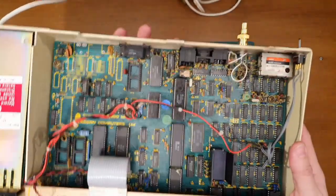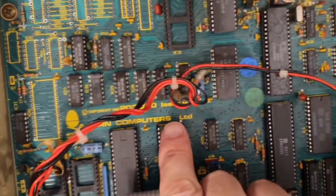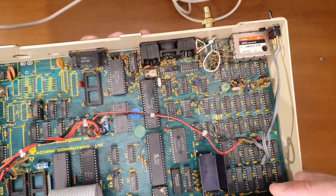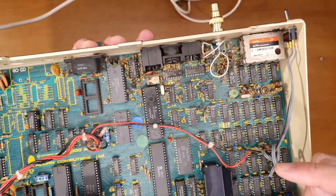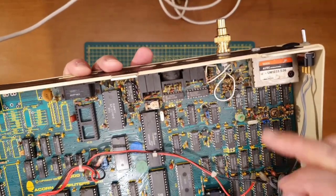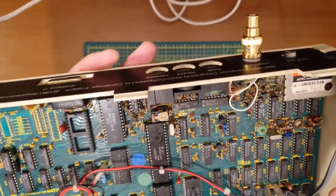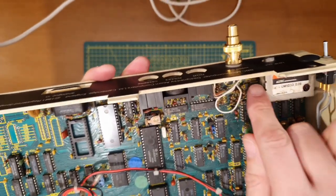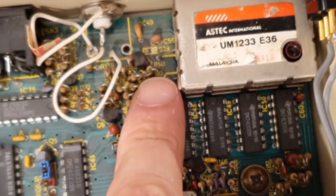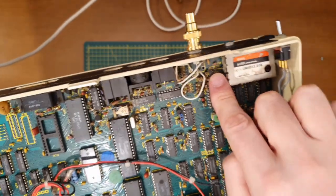Having a snoop here, we can see that I've got an issue four BBC B here. And looking it up online, the capacitor I need to add is the one at C58, and I've already got that here. Very hard to see without my glasses on right now which one's 58 — there it is, just there. Let's see if I can show you guys nice and clearly. That's already there, which is pretty awesome.